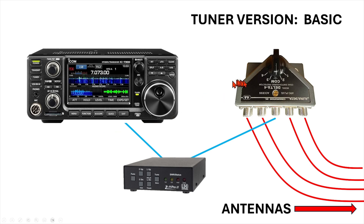What do you do if in port number four you have a resonant antenna? My LDG tuner has a bypass mode, so I can bypass on any antenna that I want or tune on any antenna that I want, and then it's going to feed into my transceiver as a matched signal.